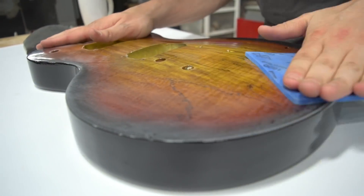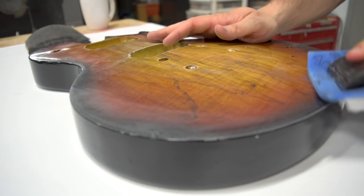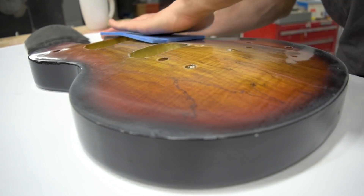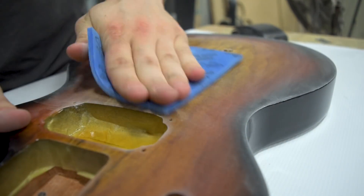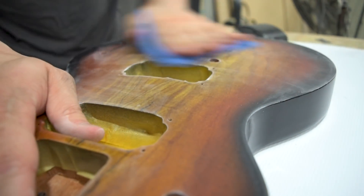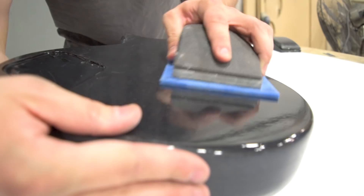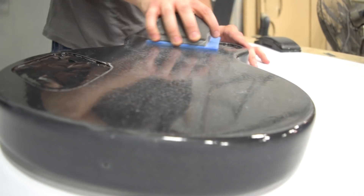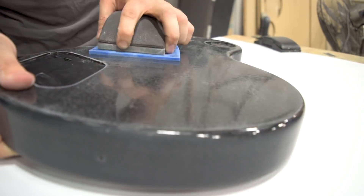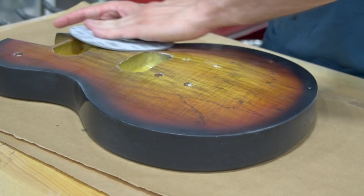Moving on to the polishing process — I have several videos on this if you're unfamiliar. I'm starting off with some 1500 grit paper, using a combination of hand sanding and block sanding. You can of course use a random orbital sander, but hand sanding tends to work quite well. I do NOT wet sand my guitars — if water gets in underneath the finish it can cause cracking, more of a danger with lacquer than with a 2K automotive finish, but still a risk I'm not willing to take. For the flat back I can use the block at all times; for the curved top areas I just use the palm of my hand.